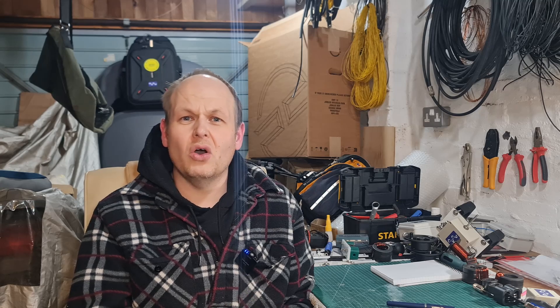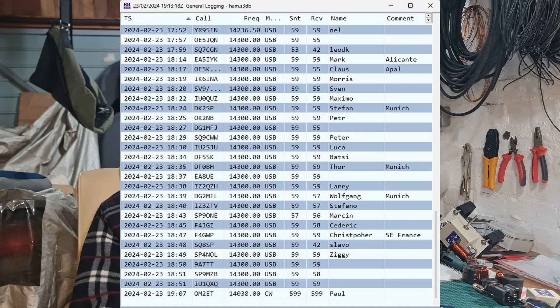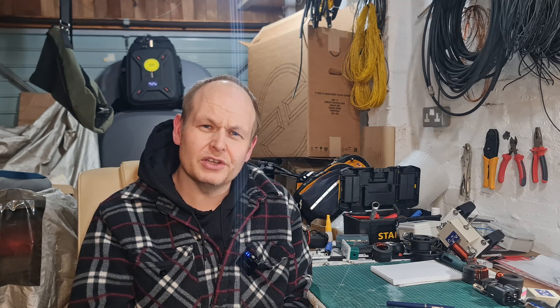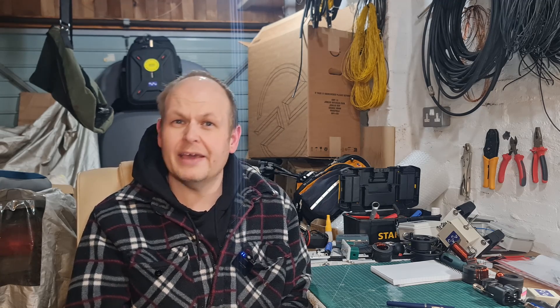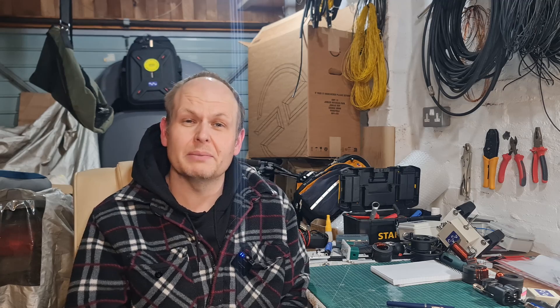All in all we made about 30 contacts, all around Europe. I did have a little bit of a pile-up going. But I would say I was probably running too much power — I was appearing deaf to a lot of stations. Quite often stations were five-and-five or five-and-six to me, yet they were telling me I was five-nine-plus-ten, five-nine-plus-twenty. So more power does work, and the efficient antenna is probably the main thing, but it really was probably too much power.